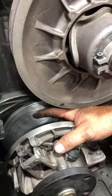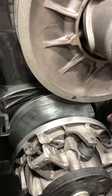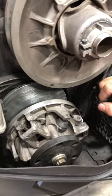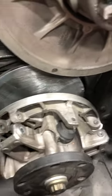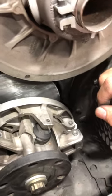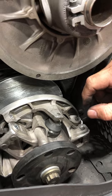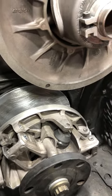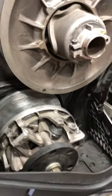The last step in cleaning: we always recommend cleaning the sheaves to get rid of belt residue. Use an 80 or 100 grit emery cloth in circular motions to clean that all off, so you get better contact between the sheaves and belt — it'll increase belt life and also increase performance significantly. Wash off the residue with something that doesn't leave any residue; we recommend acetone or paint thinner. Then everything goes back together the same way as we took it apart.